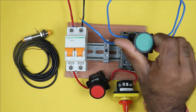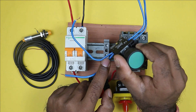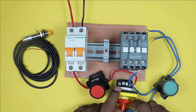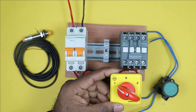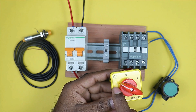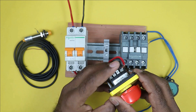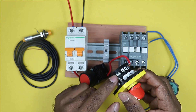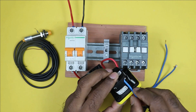This is my start push button — on both sides I have connected two wires. These two wires: one will be connected with the selector switch at the manual position. Manual position means if we rotate the selector switch towards the number 1 side, the power supply flow will be for manual. If you keep the selector switch at number 1 position, the power supply connected through the red wire will be available at the A1 terminal — so A1 terminal is for manual. I am connecting this wire to that terminal. Connection is done.